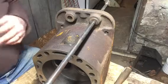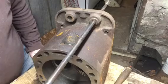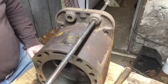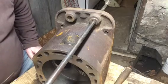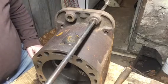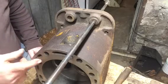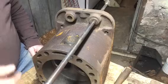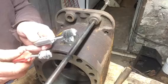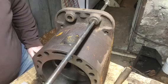So right now, I'm going to continue with, let's see, I'd chased the threads. I decided I have to clean the head bolt holes. I'd kind of forgot about that, because you don't want any dirt coming out of those, falling down when you install them, slide them down over the studs. So, when I took that 327 to town, I stopped and got some brushes. I was thinking about what kind of brushes to get through there to clean that with, something long enough, and I came up with these wire brushes you use for plumbing, cleaning copper fittings before you solder them. And I got 3 different sizes.